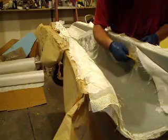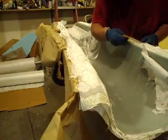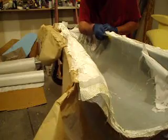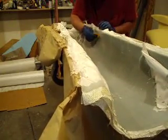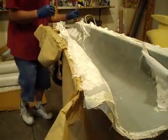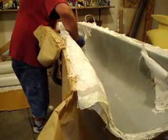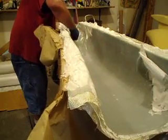Saturate that peel ply. I found that when I trim my edges, I leave the peel ply on there, because we only want to wait about 4 hours, and then I trim all these edges. You leave that peel ply on there. It's better to leave the peel ply on, not quite till it's all the way cured out, but almost, and it peels off better, I found. So probably 4 hours to trim the edge, and about 6 hours to pull the peel ply off. And man, you get just such a nice finish on the inside. Holds glue really well and gets rid of that wax.